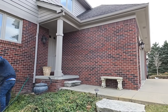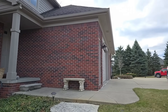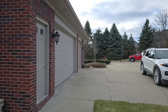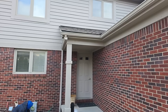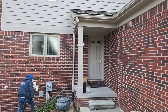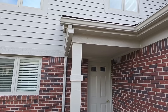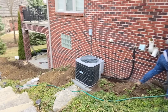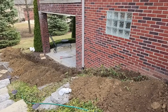This downspout — you can see this main gutter run goes across the front, and there's another gutter on this gutter trough. So there are two gutters but also two downspouts. Even though at first glance this looks really short, you have water dropping from the gutter above it, so there's going to be a fair amount of water. They're two-by-threes, so there's only so much a two-by-three is going to give you even when it's maxed out.